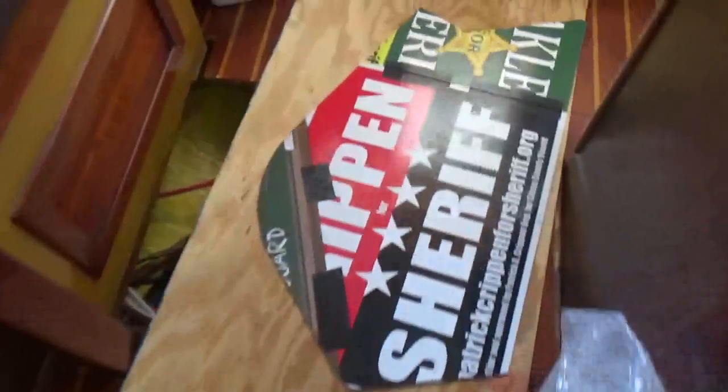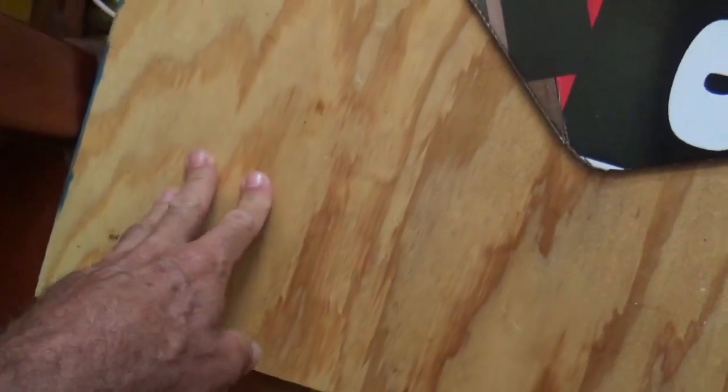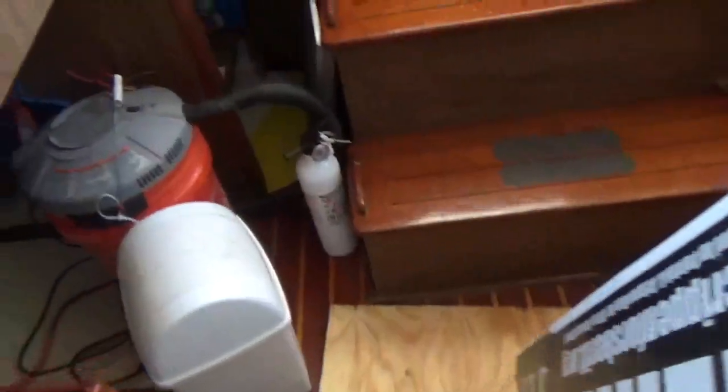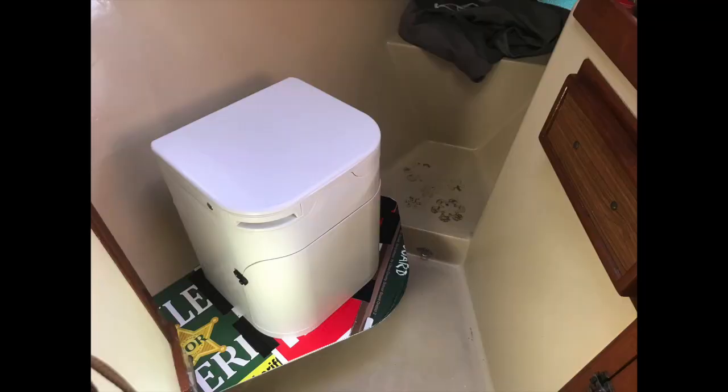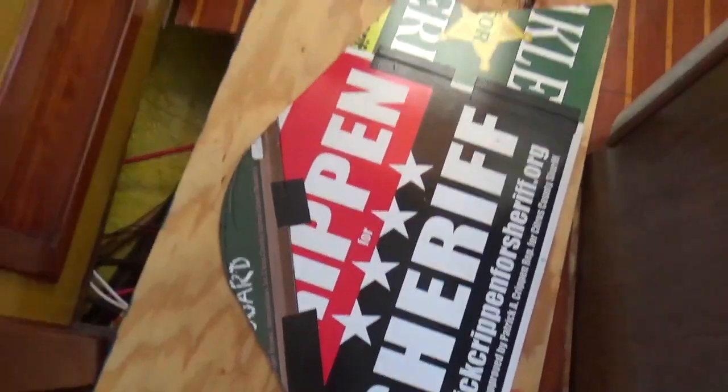Rather than trying to muscle a piece of plywood around and make trial-and-error cuts, it's much better to make a template using paper, cardboard, or — as my friend Ron recently put me onto — old political signs. When you finally get the design and the shape you like, then you get busy cutting the plywood. That's the plan.